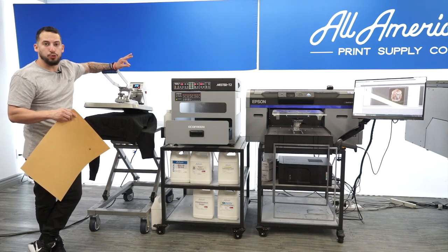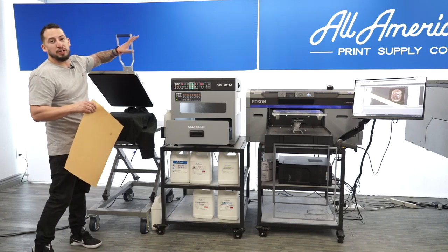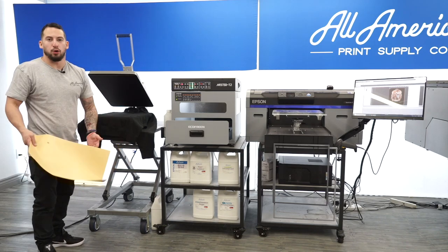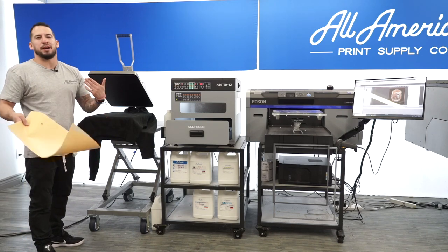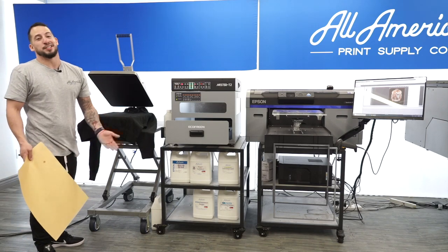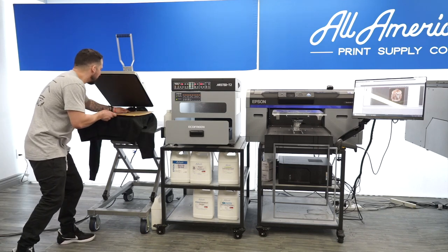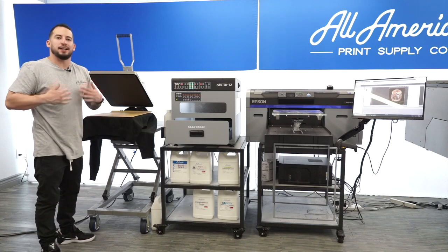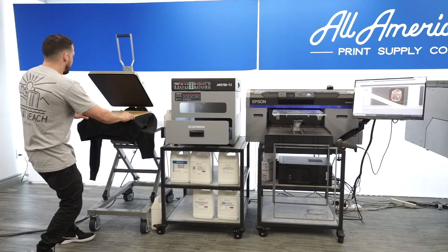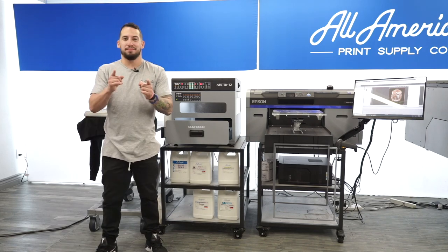The sheet allows all the temperature to go through and gives me a nice dry. I'm running my Stahls Hotronix 16x20 Auto Open at about 350 degrees Fahrenheit, and I'll change up the amount of time between presses depending on what step I'm on. I'm going to close this down now, making sure those drawstring cords are not in the way. We're going to give this about half a minute and after that we'll be ready to print.